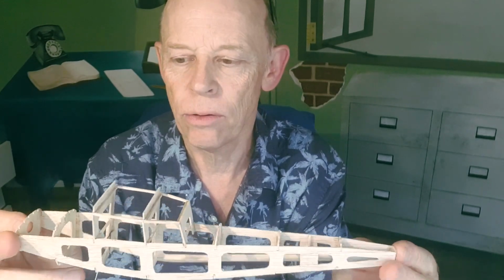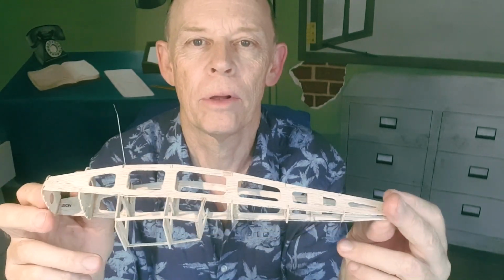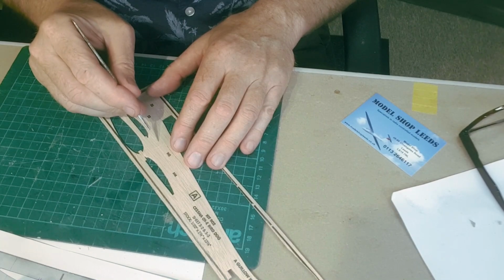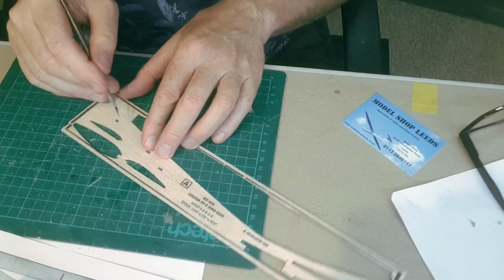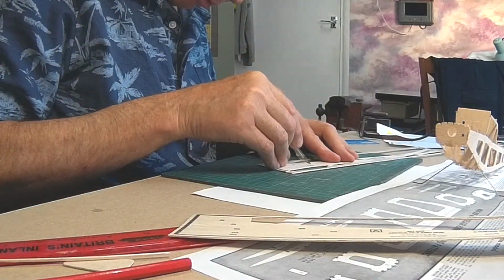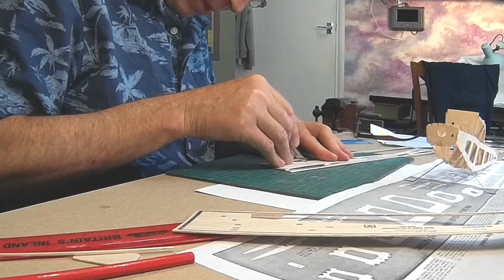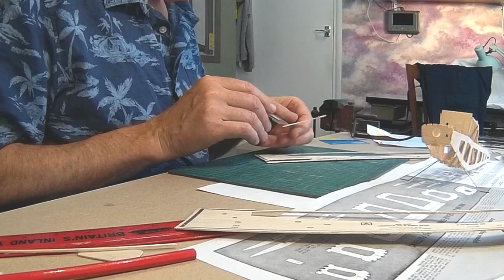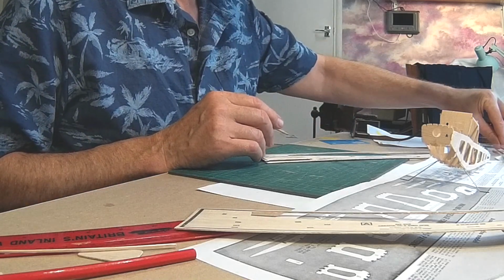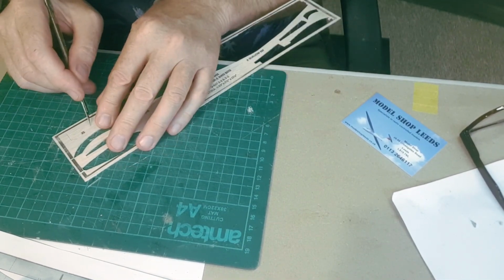I'm just cutting out a couple of the rest of the balsa, actually. Let me angle you down a minute. So if this was laser cut, it would have been obviously a lot easier, but it's called die cut because it's cut out with a big stamped down die. But the quality of the die, as it gets more and more worn, tends to crush the balsa instead of cut it, hence the expression die crushed.